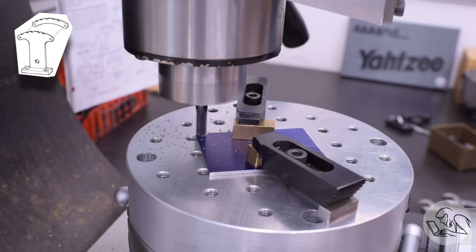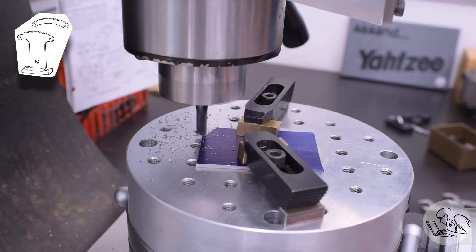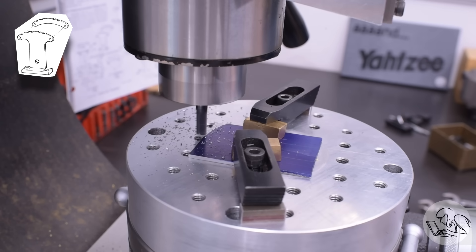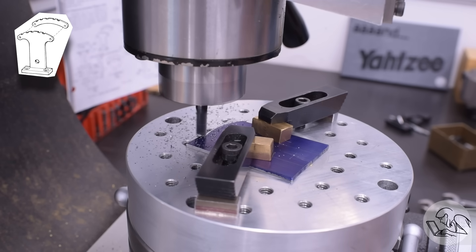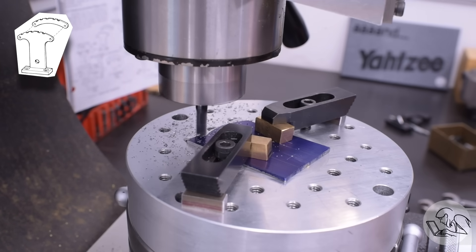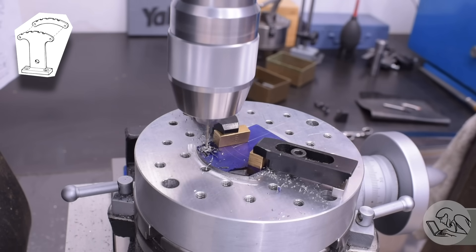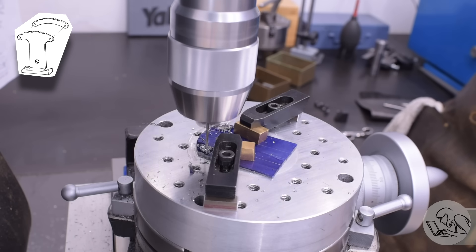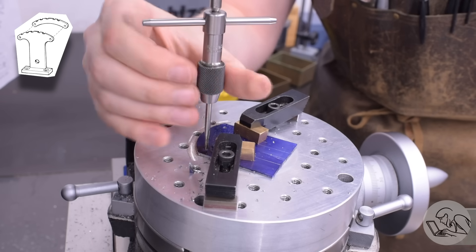I've left a big empty space at the top of the part because I'm going to start by machining the mating part to the quadrant. If you look at the drawing in the corner, you'll see there's a little arc piece attached to the side of the main stand that gives a pair of rails for the reversing lever to ride in — and I'm going to cut that out first. My stock is plenty oversized so it doesn't actually matter how the steel is laid out; the radius of that arc is set by the offset of the rotary table from the mill spindle, so I can start anywhere as long as the cut stays fully within the material.